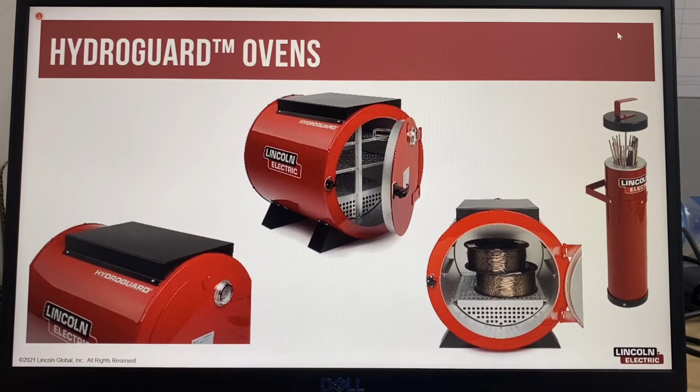So this is the Hydroguard range of ovens designed to hold up to 160 kilograms of electrode. It's unique in the circular design, distributes heat more evenly, and directs moisture to the adjustable vent at the top of the door. That's here. This is the vent. Temperature is adjustable from 38 to 228 degrees C, and an indicator light shows active heating.